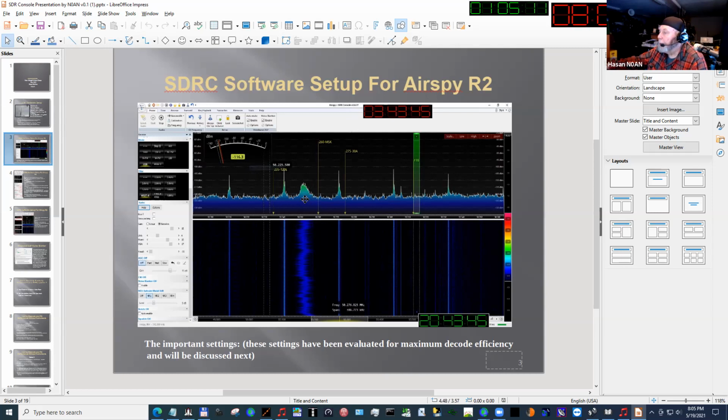This right here, which a lot of people have seen on their setups, this is what I call my roving mini Mobi hump. It's an interfering signal. It slides up and down the band. Mine actually moves every time I transmit. And it will sometimes slide right through my operating frequency. We believe it's being caused by some sort of a charging device in my house because I don't have any near neighbors. And it is a pain to deal with, but I am not the only person to report this kind of a problem. So if you see it, chances are, unless you have real close neighbors, you're going to find it in your own house. And it could be just about anything that uses a wall wart or something like that.